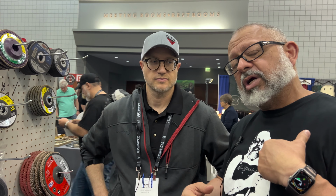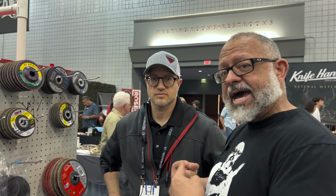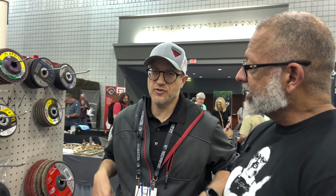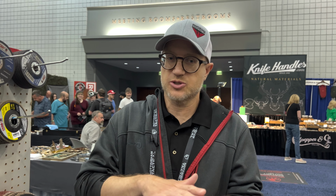It is. I had some actual belt questions for him that I'm going to get from him since I have the man here. I had actually asked him, for those of us who are hand sharpeners, when I see the 800 grit on a stone versus 800 grit on a belt moving fast, are they really the same grit? And his answer was, no, it's not. A moving belt is actually going to give you a smoother finish because typically you have rubber behind it or some sort of cushioning agent behind that belt, which is going to soften the belt. Versus a hard stone, there's nowhere for it to go, so you're going to get that true scratch.